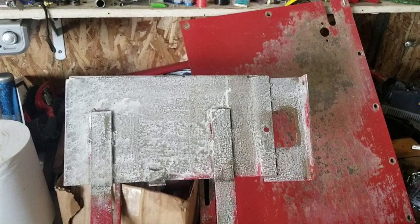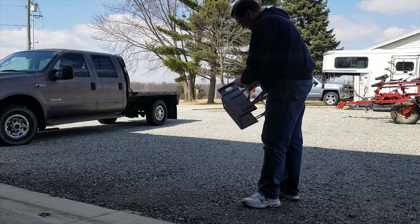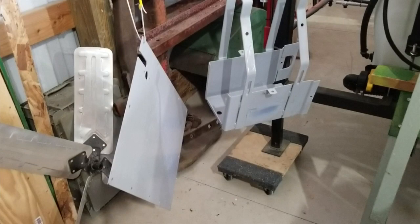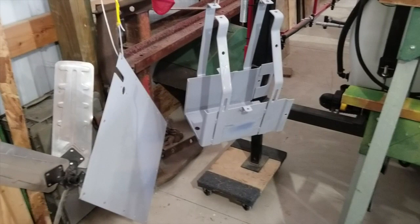It's been more like a week here between steps. But this is what it looks like the next day - it dries a chalky white. That's a reaction with the rust. You can see the top there, and that one after you wash it off. They've had plenty of time to dry, so we're going to prime them here real quick and then we'll get on to the next step. Alright, we got them primed. The instructions say you don't have to - you can paint right over that coating since it works as a primer. But we're going to give it a little extra protection, especially since that's going to have a battery in it. We'll give them 24 hours to dry and then we'll get back and paint them tomorrow. So stay tuned.